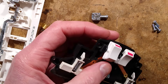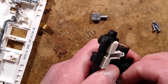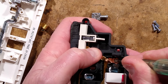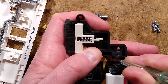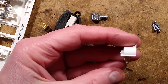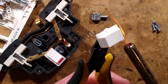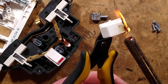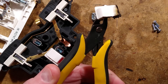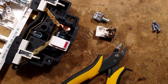So what has actually gone wrong here? It would have been good to get one of the ones that's already broken — one of the ones that's supposed to have gone on fire. Is there something in the construction that maybe just gets hot and melts, and then the contacts get further apart? I don't see any obvious position where you'd get tracking in here. Let's hold this in a pair of side cutters and set fire to the button. Everything I've tried to set fire to so far has just gone out.